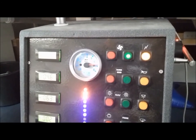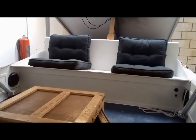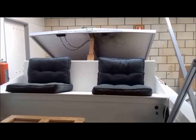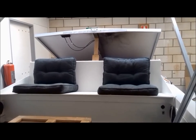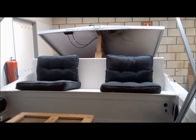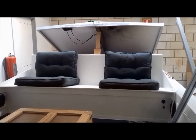This is the max RPM when the motor is free-running — it's not in the water now. When it's in the water it will be about 500 RPM. The boat has 8 solar panels, each rated 265 watts peak. In total, under ideal circumstances, I only get about 1,800 watts, but that's more than enough to reach 8 to 9 kilometers per hour.